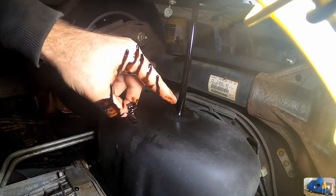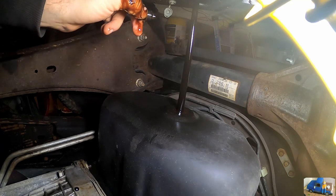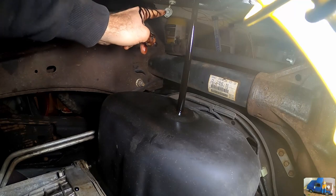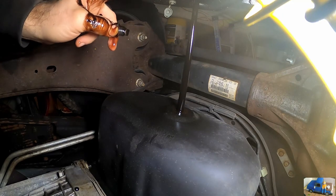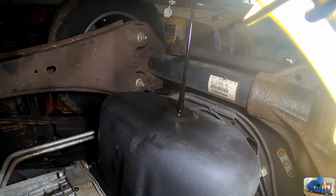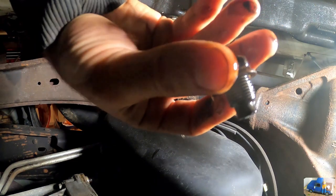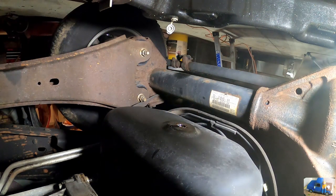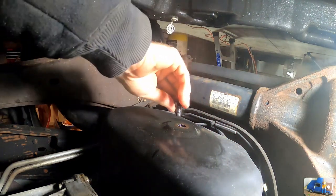You want to be careful — sometimes this drains so fast that your drain pan can't let it drain into the tank fast enough. The vent cap you want to open, but sometimes I have to pop the drain cap on it so it drains fast enough. Make sure there's no metallic particles on the end of your plug. Clean her off, clean the washer off, clean off the sealing surface of the pan, and thread your plug back in.